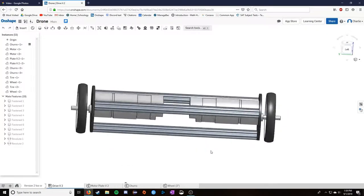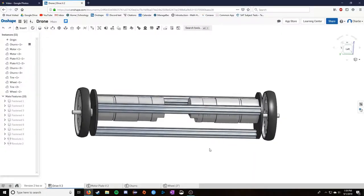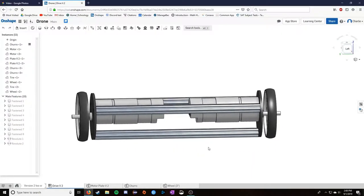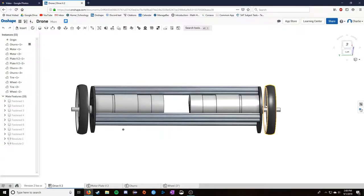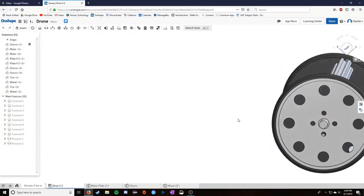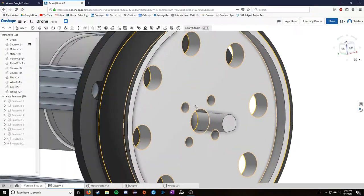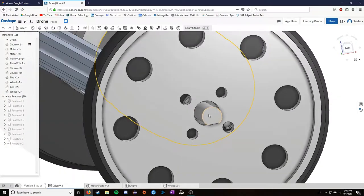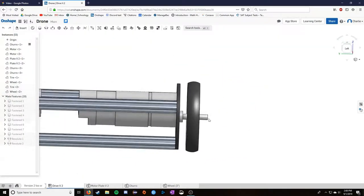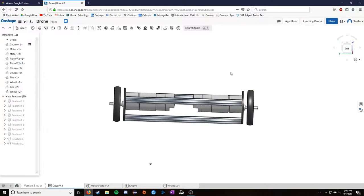On top of that, it still fails even more because I was still trying to get away with direct driving wheels, because driving indirectly is a whole lot more work and it takes a lot of space. I hadn't even tried it before this, so I learned it through this project. So this shaft again drives straight through the wheel. There are pieces that attach this mount point, four holes and one bigger one, to this sort of cutoff circle. So that does exist. But once again, cantilevered and direct driven.